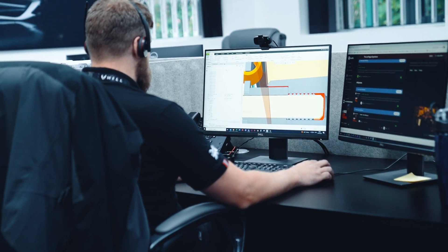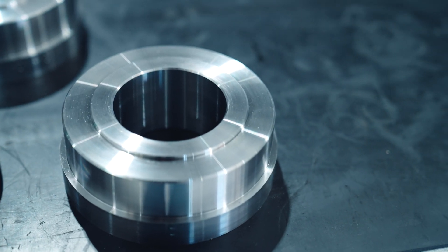Everywhere else that has the copper plate is masked. The reason we do that is we don't want to harden around the body area — we just want to harden in and around the teeth. And why don't we want to harden the rest of the area? Because that would make it brittle. So in that area we don't want any brittleness. That's the reason we design very carefully and quite conservatively — we buy the finest quality materials and control the tolerances.